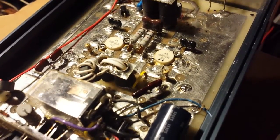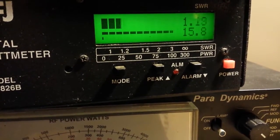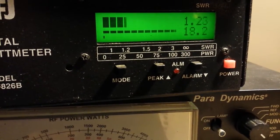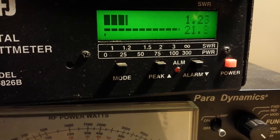Should give you about 350 watts, no problem at all — probably even peaking up around 400 watts. We're not going to see that now because I don't even have my driver hooked up right now. I could hook it up but I'm kind of limited on time. We're just going to hit it with a radio. Like always, let's let you know what we're working with — we're going to be driving about 18 to 20 watts into it. We'll just say 20 to be safe.